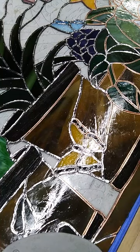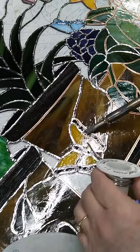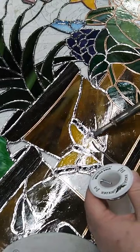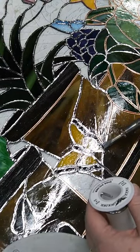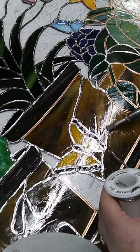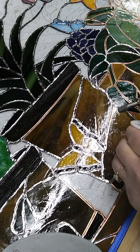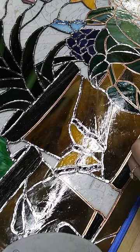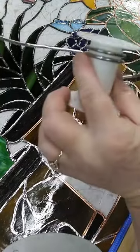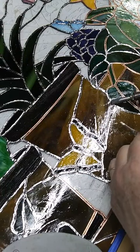A lot of times, especially finish soldering, I'll have 2 soldering irons plugged in because the soldering irons can't keep up with me. They cool off. I'm feeding it too fast for the heat to penetrate it all the way. So I'll switch off and on every once in a while between the 2 soldering irons. And you can see this is my first roll of 50/50 so far yet. I'm going to run out. I'm not going to quite get the whole panel done.